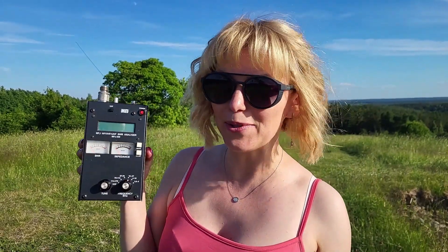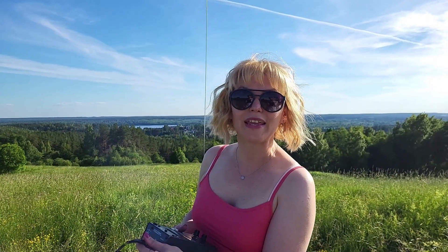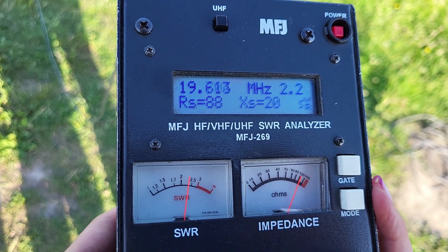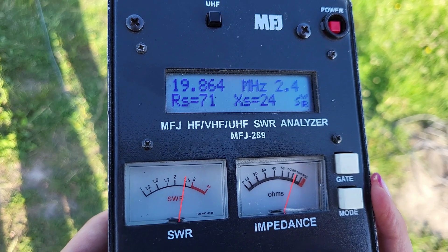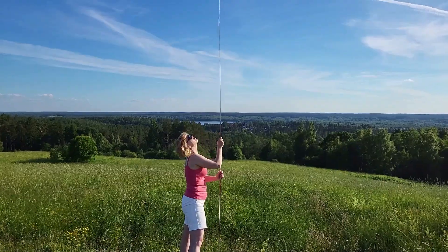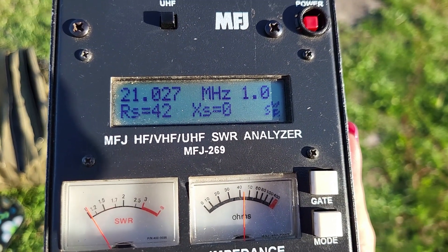I did it! Three different types of antenna are ready to work, and now time to check SWR. First one is ground plane, GP. I need 15 meters band, but the resonance is too low. I have to make my antenna shorter. Now it's perfect.